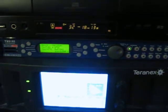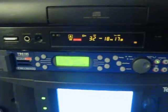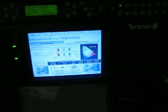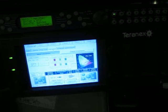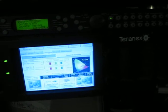For conversion up to HD, it comes out SDI from the Kudos over to the Teranex, which is running an upconversion. It converts it up into 1080 P24 — which is really 1080 P23.98 — or 1080i, or any format I want on the output.